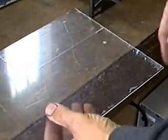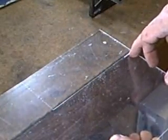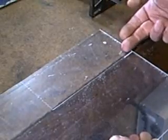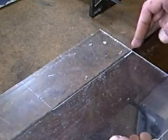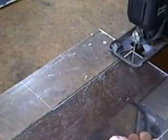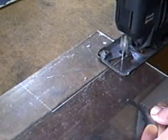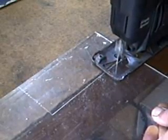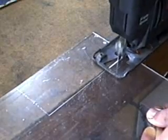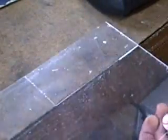Just to show you how nicely this works, I'm going to line up the notch that I'm cutting — I'm cutting off this piece of material right here. My cut line is just to the outside of the line that I've scribed, and I'm holding it within a quarter of an inch from the edge of my bench so that it adds some back support to the plastic as I'm cutting through it. You have to go very slowly through this plastic because otherwise it will shatter — I've broken off a couple of corners already. You'll notice how all of the chips were expelled down below and I was able to easily see my line as I continued to cut through.